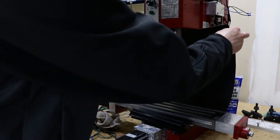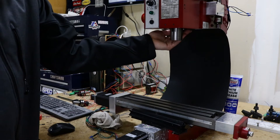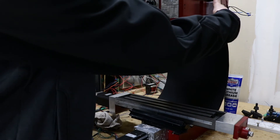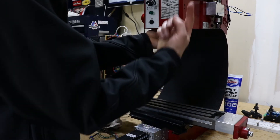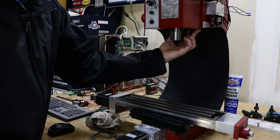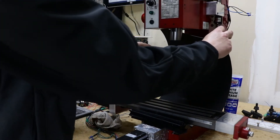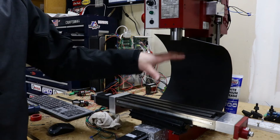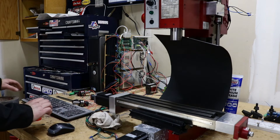We can actually offset it a hair too. I kind of like the idea of mounting it forward like that instead of way back here. Because this way, with that C shape, since I don't have anything up here, it kind of shields stuff from going this way. It'd take a heck of a chip to come up over that and stick on there. So I think I might mount it as close to the spindle in the front as I can. Before I start really dialing this in, I want to just tape it on and run my machine through its extremes — it's already at one extreme. Now I want to bring it down and back and see what that looks like.